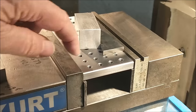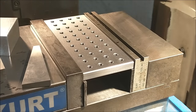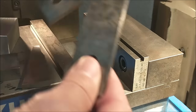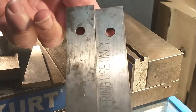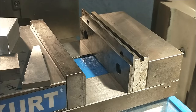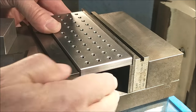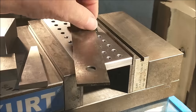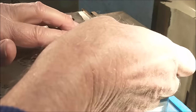Now the part is positioned at 15 degrees — or whatever angle block you put on there — clamp it down, away you go. What if your part doesn't fit between the confines of the jaws? That's not a problem either. Go back to the original parallels, but instead of using a single parallel on the back, add a couple more. Now you have a tremendous amount of projection and swing room with the part, plus a back fence as a stop.